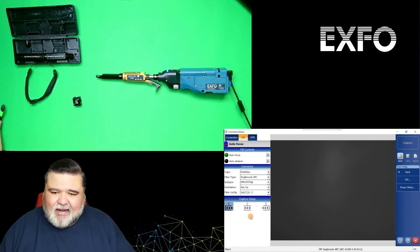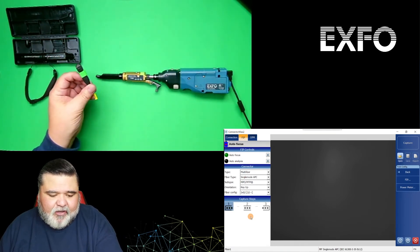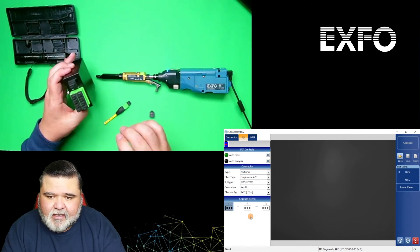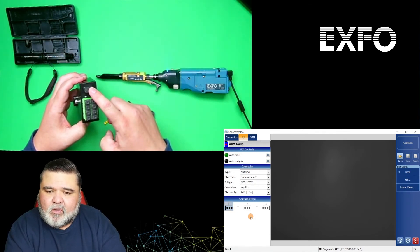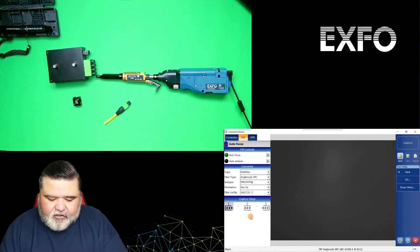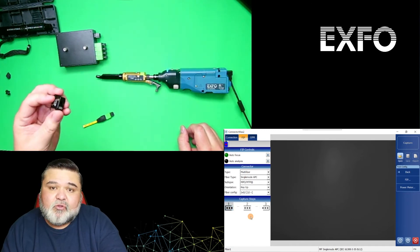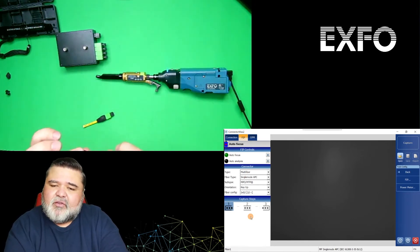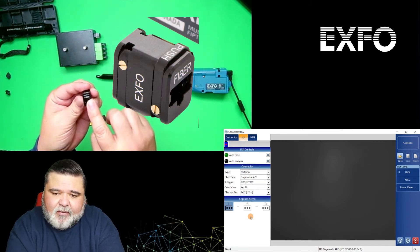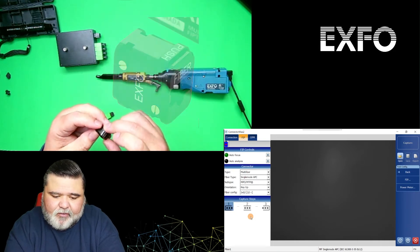I have this MPO fiber jumper that I just cut off to carry around for demos. I also have a little breakout box I acquired while doing some testing — it goes MPO common to eight-fiber breakout, which gives me an option to look at a bulkhead as well. There's a little bulkhead adapter that comes with our fiber inspection probe for multi-fiber. Using a standard MPO bulkhead has too much play, so this dedicated adapter works much better. It has two sides — one says Fiber and the other says FIP — with a spring-loaded device on either side to really secure the fiber and the probe tip together.